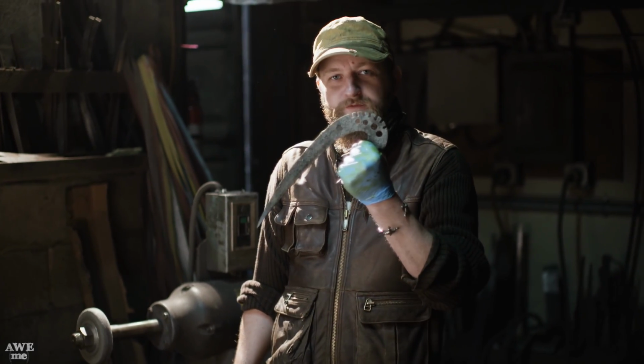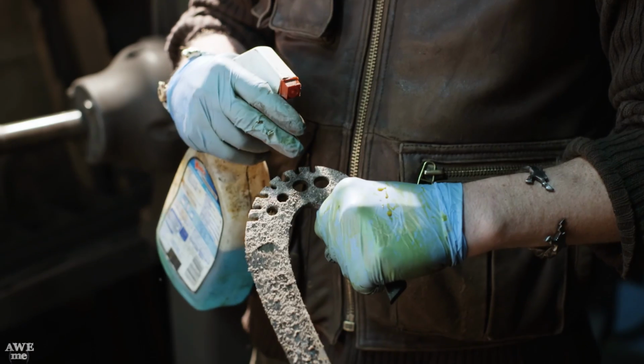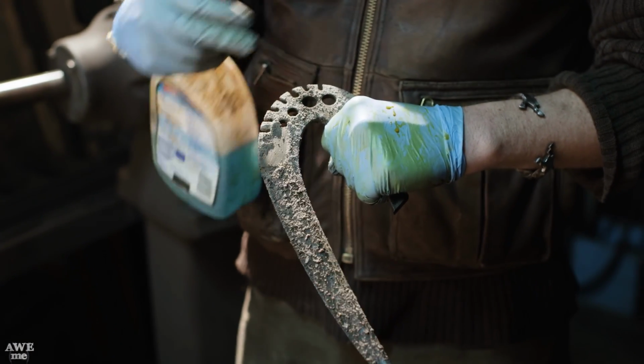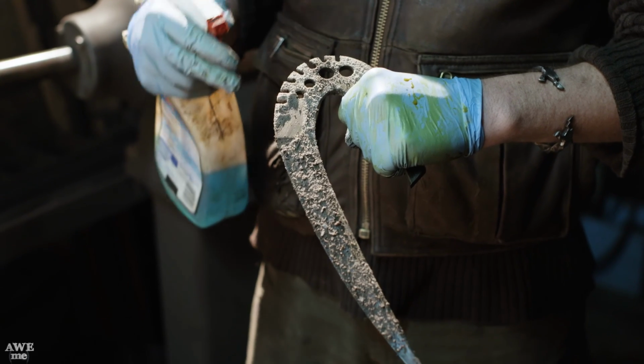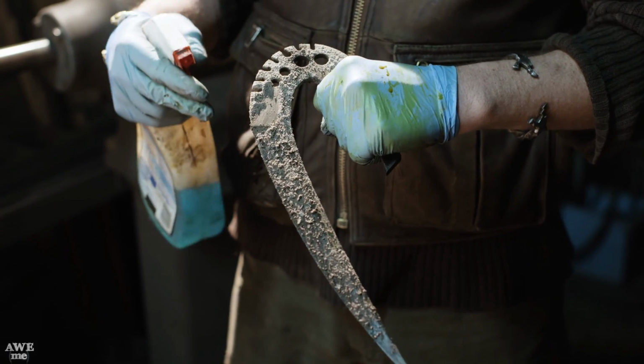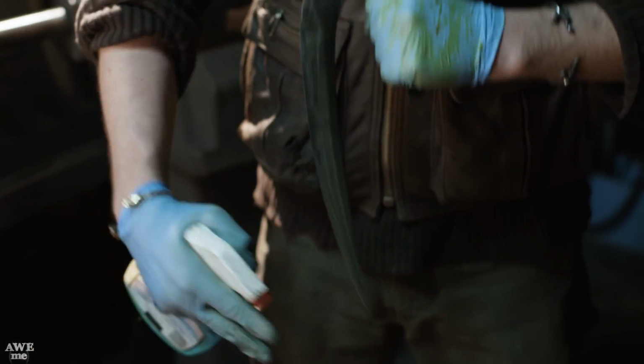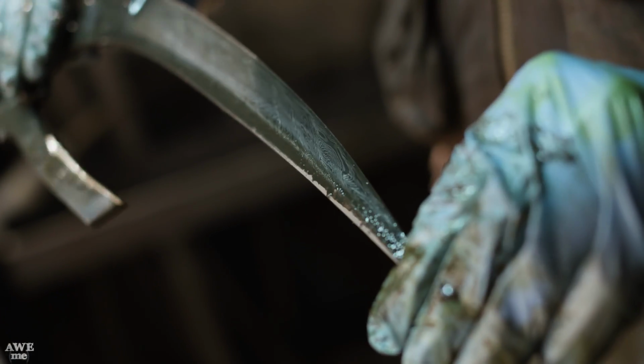All right, now our blades are fully etched. You can see I went ahead and spread some white ash along the whole surface of the blades. Just because ash is very basic, we had it sitting in an acid, so now we need to use a base to neutralize. I'm now gonna spray it with some Windex, which has some ammonia in it, just to clean it off and add a little bit more neutralizer. Then we'll move to the buffer.